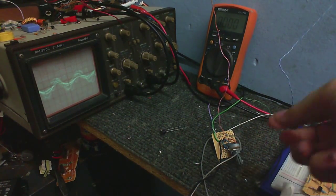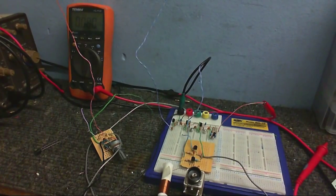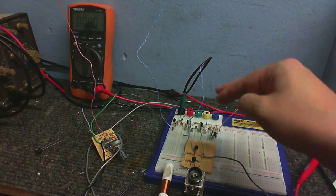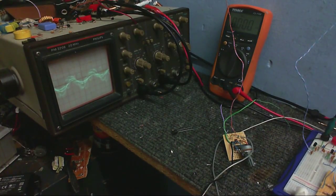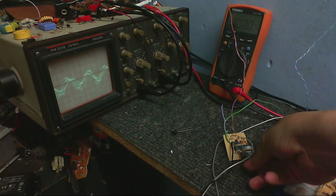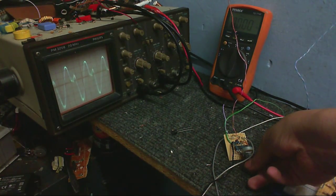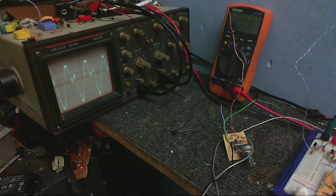So anyway, what I'm going to do is I'm just going to turn this until I get the highest output. And oh yes, the local oscillator, even though it's connected, it's not powered at the moment, so that's not doing anything. So that's not going to interfere either. Tune this until I find the highest and cleanest output. Okay, it looks like right about here, I'd say. Yep, right about there. That's where I'd say the highest output is.